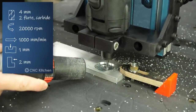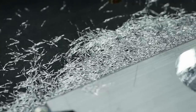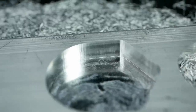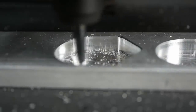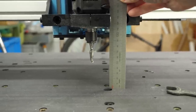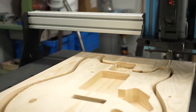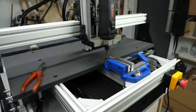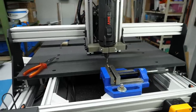And of course I had to try machining some aluminum, which worked better than I would have expected. The Evo S nicely chewed through this piece of aluminum at decent speeds with very nice chips and a good surface finish. Even though this router's main use should be wood and plastic, it can definitely be used for more challenging tasks if you don't expect the performance of a milling machine. Unfortunately, one of the limiting factors is not the capability of the Evo but the clearance height on the Z-axis — with the wasteboard you only have around 70-80mm of clearance, which doesn't allow you to machine thick materials. The 40mm of the guitar body was right at the limit of what's possible. Mounting a vise is hardly possible and the few times I used one to cut open some 3D printer nozzles, I had to remove the wasteboard and fix the vise directly to the frame.